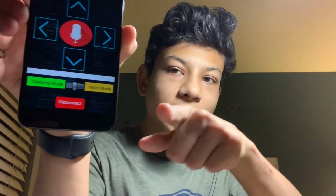The last step in this was to add 2 different buttons. Here we have the voice button and the obstacle button, and these activated the 2 different modes by sending 2 different integers. And now I have an object detection function and a voice command/remote control function, which is great. The next modification will be to add a servo, which essentially makes the sensor look left and right.